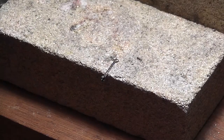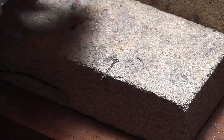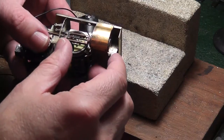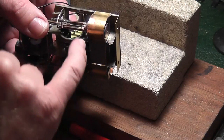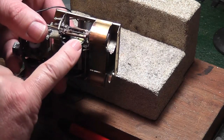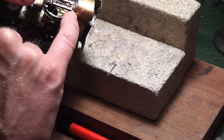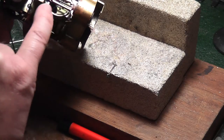The advantage of this is it's very easy to do. It's very hard compared to soft solder, so it's much more solid. And of course, if I now choose to soft solder something to it, it isn't going to melt. So that's a great bonus — I can touch it as much as I want with a soldering iron and it isn't going to go anywhere. That's a tremendous advantage. For instance, if we have a look at these crossheads that are silver soldered here, not to mention the slide bars to the cylinder end covers — these are all silver soldered joints, which meant that when I soldered the cylinder end covers onto the cylinder assembly, there was no danger of anything coming unsoldered.